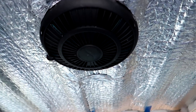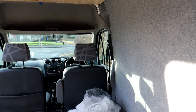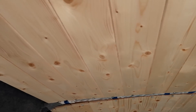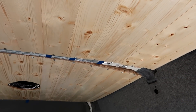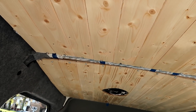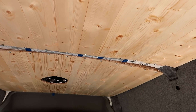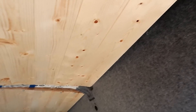Finally all the roof is paneled, all insulation up above with the foil and insulation stuffed up as I went along - did a few, shoved some in, did a few more. It was a bit of a pain actually but I think it worked out well. I've used some Danish oil - you put a coat on with a cloth and give it about three coats with six hours between. That will provide a waterproof finish on the roof. Quite chuffed with that.